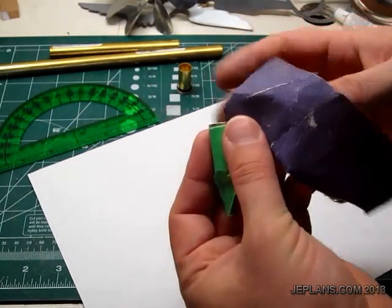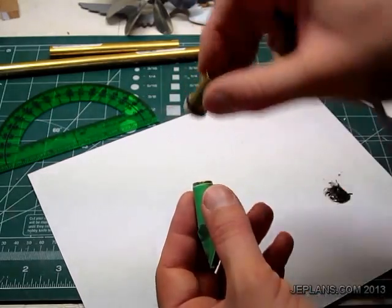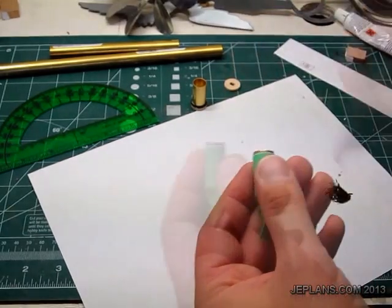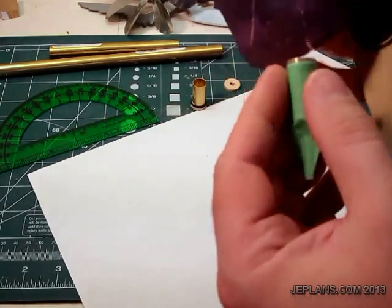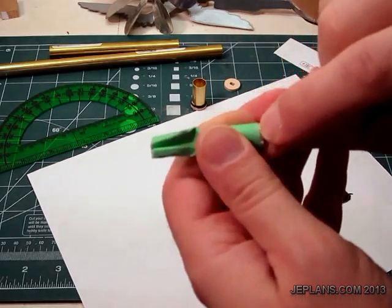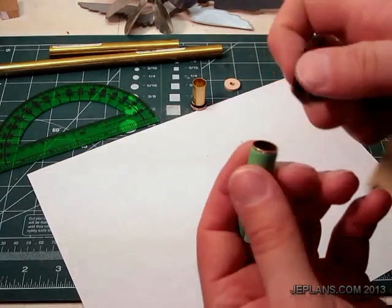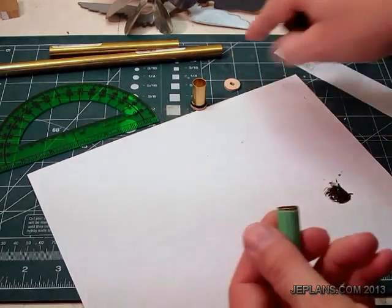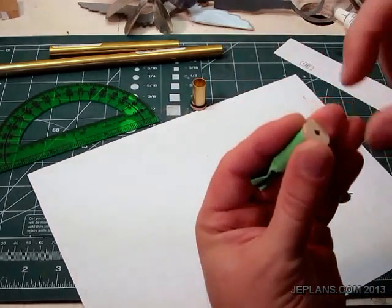This will be the interior piston portion. It is going to be assembled pretty much the same way as the exterior. First we are going to score the edges - get a little sandpaper and rough them up a bit. I taped it off so I don't mess up the rest of the tube where it is going to be sliding and in contact with the exterior portion. Because it is the interior we can score the inside a little bit and put a little epoxy on that side too. It should flow down onto the wood piece. There is going to be a hole in the bottom - that is where it attaches to the air channel to feed the air in.